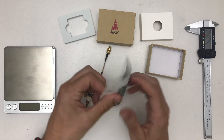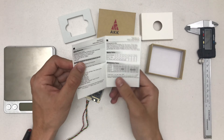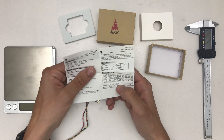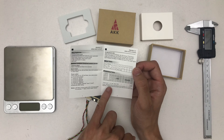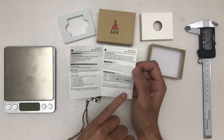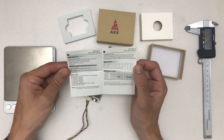Another interesting fact: while smart audio has different power levels, if you set 800 mW as the smart audio command it will actually jump to 1200 mW, and 25 and 200 are the same. The 500 mW setting triggers the 600 mW setting, so keep that in mind.